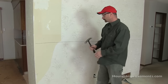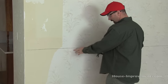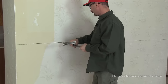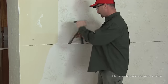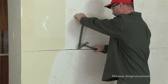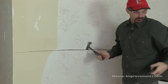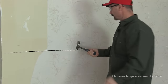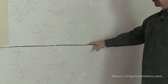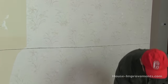I've made that cut, so now I'm going to go to a spot in between studs. I'm going to get my flat bar in there — I can get it through the crack and pry the drywall out. I don't want to stick my fingers in there because the second I pull the bar out, the drywall is going to spring back and pinch my fingers. So I'll get my hammer in there to take up that space. You can see how almost a whole sheet wants to come off in this case — it won't always do that, it might come off in smaller pieces, but this one looks like it's going to come off pretty good.